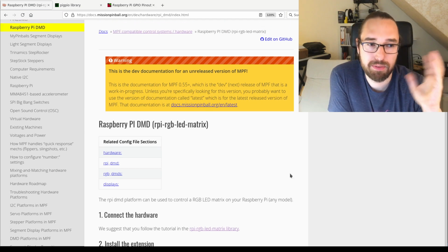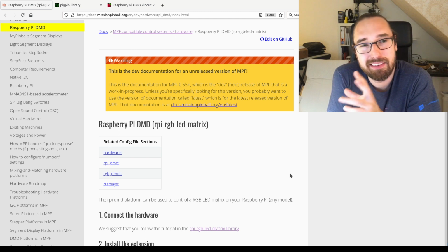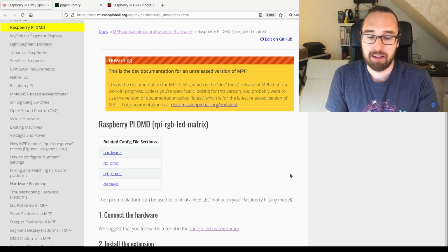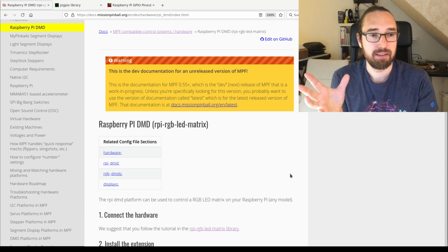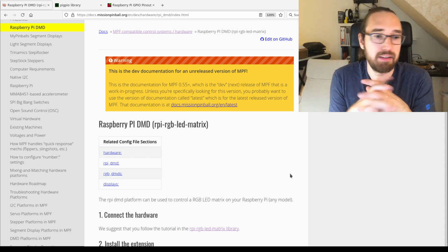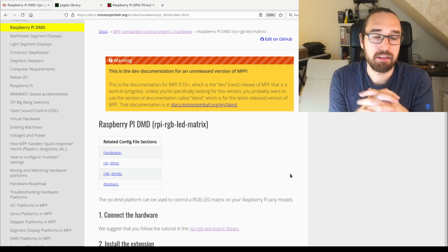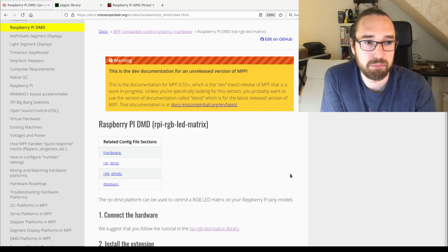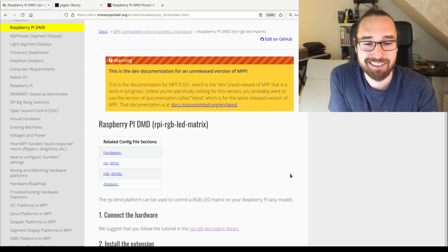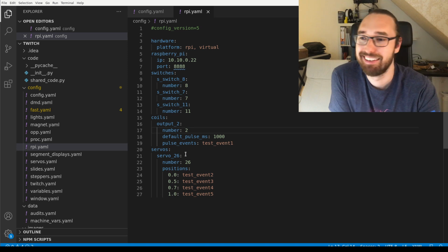Yeah, really, you can do it on Raspberry Pi 4. But still, very important, do the development part on an ordinary PC. I would not recommend using your Raspberry Pi as a development platform. So do this on your PC, use your Raspberry Pi remotely or simulate your game, because you won't be able to run a proper IDE, and all the nice debugging stuff isn't available or is very slow with only 4 gigs or 8 gigs of memory. You probably want more for that. Yeah. You want a fast PC. That's just developer ergonomics, I would say, because Visual Studio Code, what I got here, probably hardly starts on the Raspberry Pi, and it's very useful.